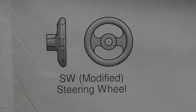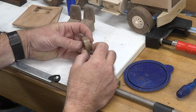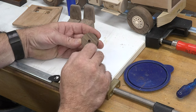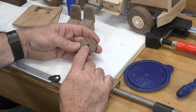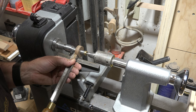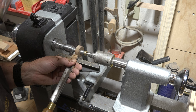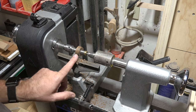Now we're going to move on to one of my most hated pieces to make: the steering wheel. You can find it on sheet nine of nine, the general views page — it is an inch and a quarter in diameter. I have a scrap of walnut, half an inch thick, cut just over an inch and a quarter at the scroll saw, with a quarter-inch diameter hole drilled right in the middle. We're going to take this over to the lathe, turn it to round, and bring it down to its final dimension of one and a quarter inches.